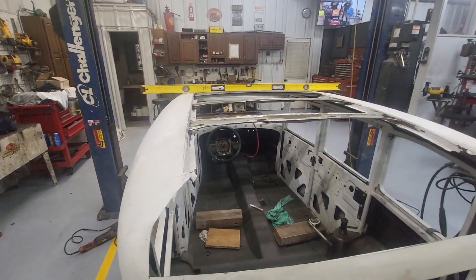I'm substantially narrower than the roof. It really doesn't matter how straight it goes because the roof is going to get cut to this profile right here. I'll braze that in with a 3/32-inch cut from a cutoff wheel — I want to have that width in here and then braze this all together, but I'm just going to plug weld it with the MIG right now, taking some time to let it cool. The shape crowns very similarly, so it's going to continue to be a bit of a challenge, but I'm able to form up smaller pieces and that keeps me going.